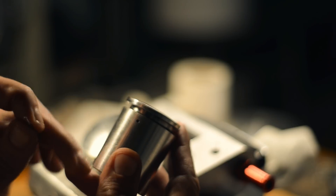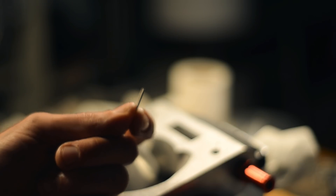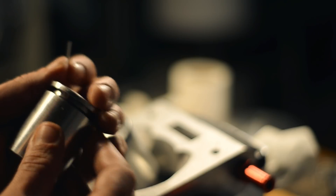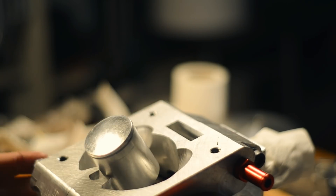There's a hole through the skirt and into the middle section, and there's a pin that's supposed to go there to lock it together, and then the aluminium will be peened over to keep that pin from coming out. But I won't do this yet — this is just for a short test with a drill, see if it snags — but when we're going to run it on power, we'll need that pin.